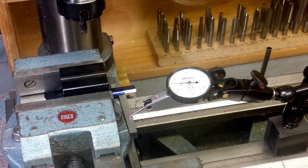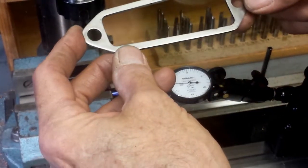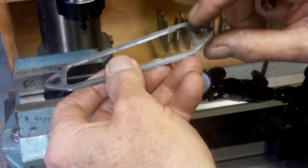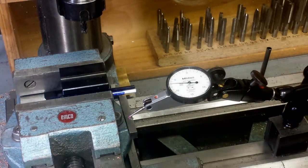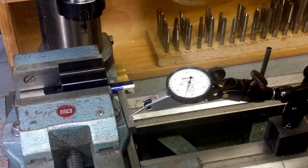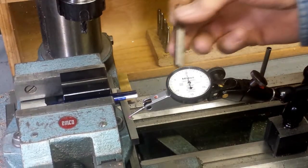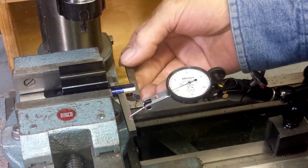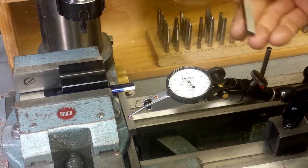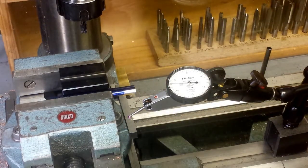Steamer Joe here. I'm setting up to drill and ream the hole through the clevis in the piston valve — that's what will drive the banjo valve. It'll have a bronze bushing that fits into the slot. I'm setting it up to make sure that the slot is perpendicular to the spindle of the mill. I've got a precision angle adjuster that I can use by tramming in this piece of tool steel. I just have the vise gently snugged up.